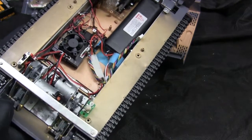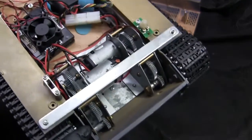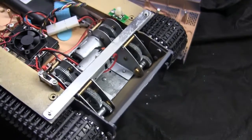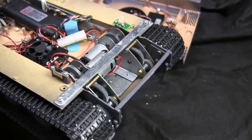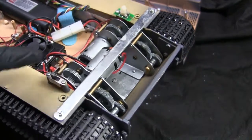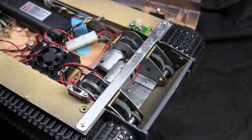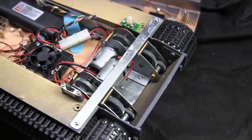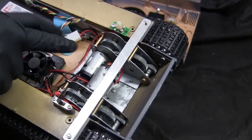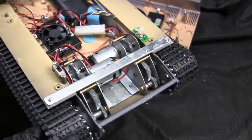The gearbox features the older zinc alloy — what I like to call the glass jaw gearbox. These gearboxes look and feel like high quality units that will last a long time, but in my personal experience these gears are very prone to breaking, wear out quickly, and do not hold up well with long-term running. This is the weakest part of the model and will be replaced with an aftermarket gearbox.